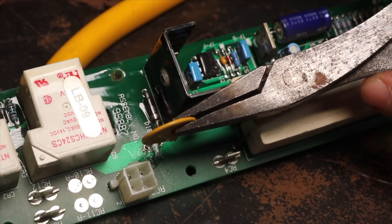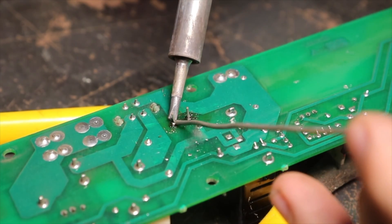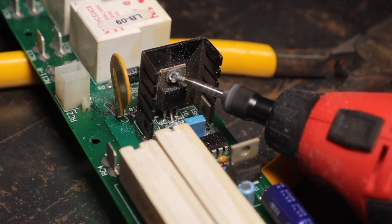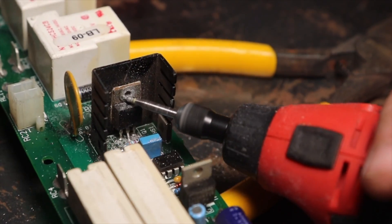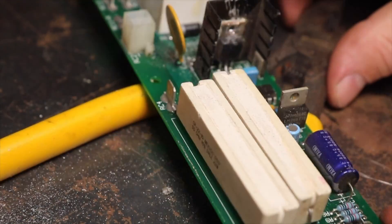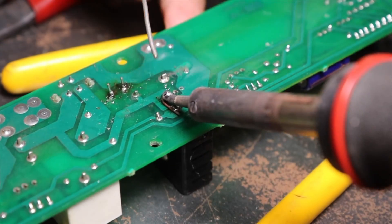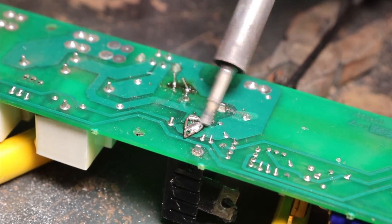We got two holes now. I've never done any work on a circuit board. The solder I'm using is plumbing solder because I couldn't find my small gauge solder until after I finished. I've never used a solder wick, but with a little YouTube university from some wise nerds, a guy can learn to do just about anything. Now I'm removing this rivet that holds on the transistor to get it off so I can replace it with the new one. One trick I saw was to link all the pins that needed desoldering with a common wire and solder so that they heat up as a group.